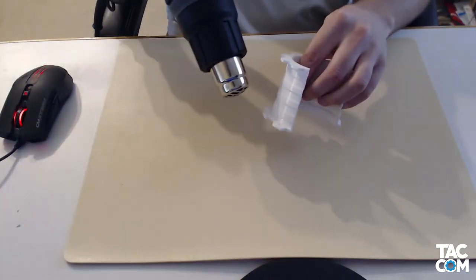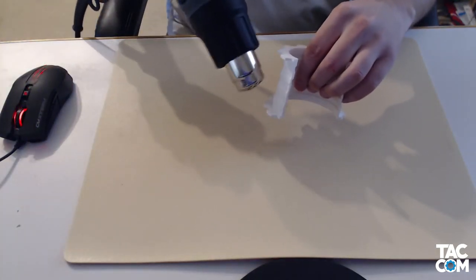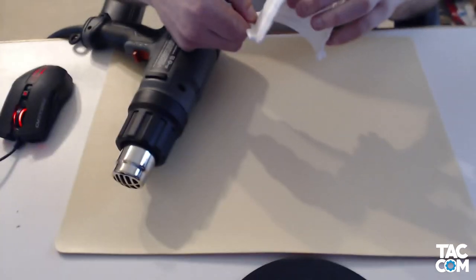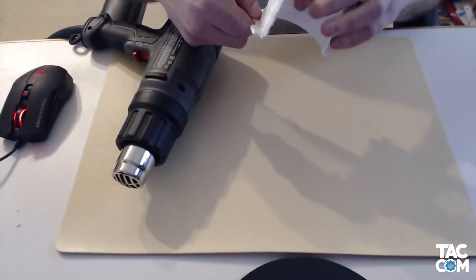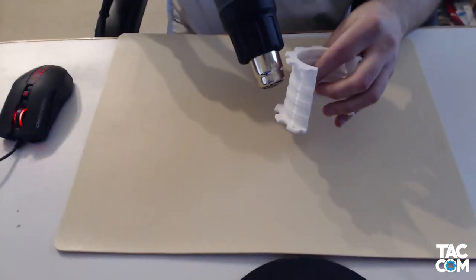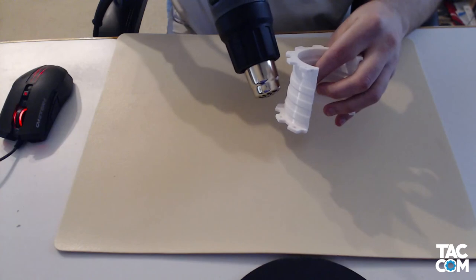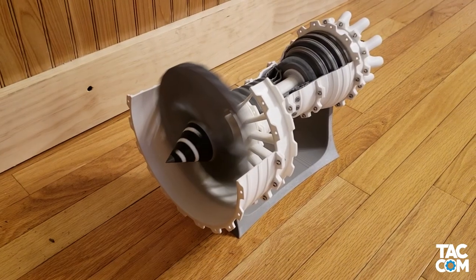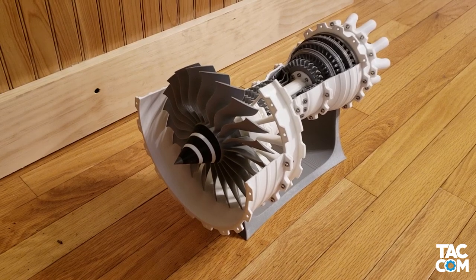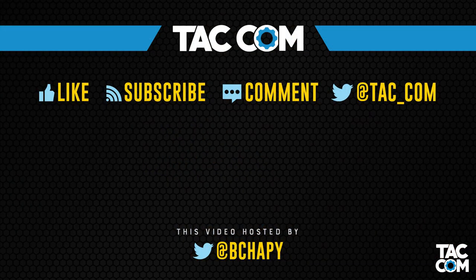The last tool is the heat gun. As many know, this can help remove strings. The main thing I used it for though were those nasty overhang undersides — many of the perimeters had loose strands. By simply heating it up and pinching it with my fingers, I was able to get everything adhered back to the surface. Make sure you don't overlook post-processing your parts. This is an awesome build and it takes some time, so make sure you do it right so that you don't regret anything after assembling it.